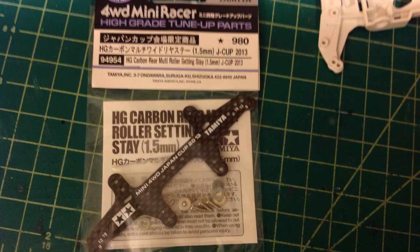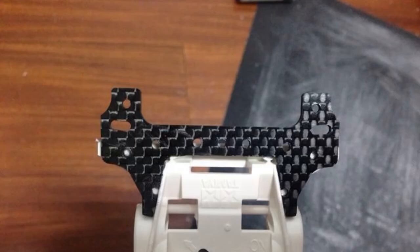A little advice: it's better to use the carbon fiber version because carbon fiber is stronger and lighter. The FRP is kind of weak and wobbly. If you have carbon fiber, you can use it to replace the FRP — but first you can use the FRP to cut the shape, then use that as a sample to put on top of the carbon fiber to trace the shape.